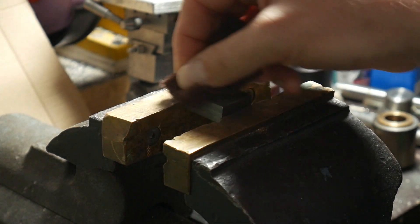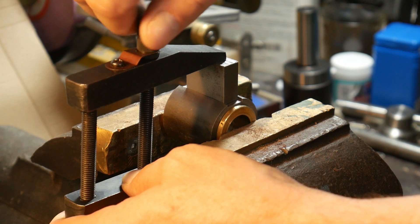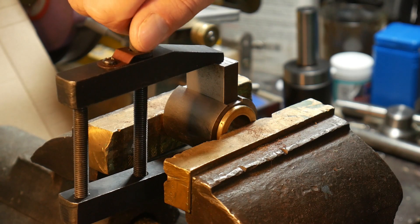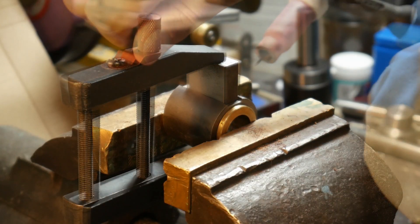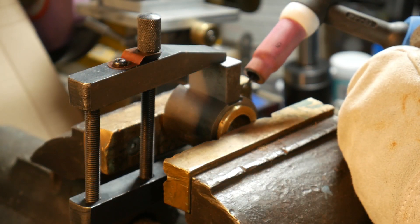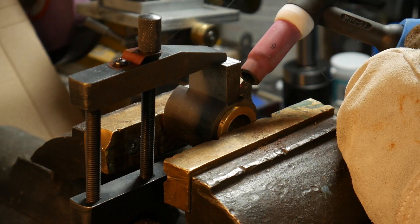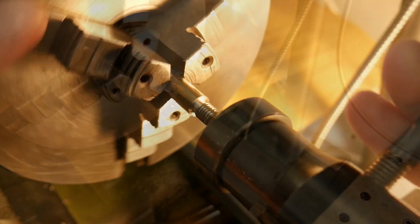I made it planar with my end mill and milling machine. The support will be welded so I clean it well. With the help of my machinist's vise I position the support to the round bar. After checking stability I use my TIG welder and I weld along the two edges.